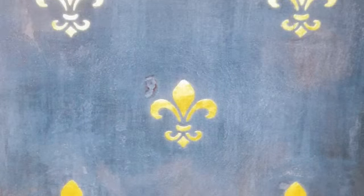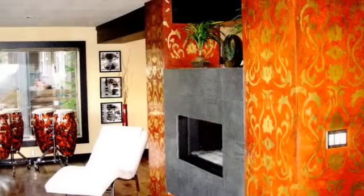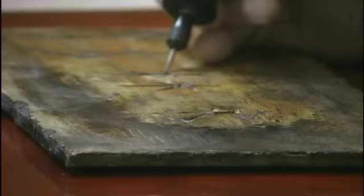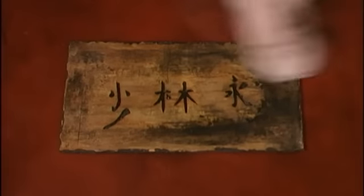You can cover the stencils or any of our plasters with real gold, silver, or copper leaf, otherwise known as gilding. Don't use aluminum leaf as it does not work well with lime. You can use a Dremel tool to carve out plaster, or you can even gently cut out parts of the plaster when it's still wet. Since texture is so important on the base coat, you can imprint something into your wet base and the second burnish coat will leave a soft impression of the first imprint.